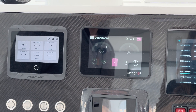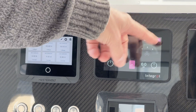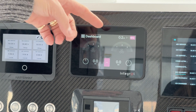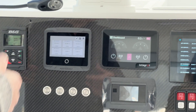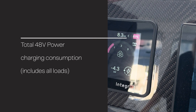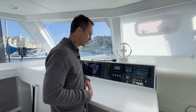So you've got a little bit finer control. The dashboard, as I said, is the main place the screen will be left — it kind of gives you your power. This is system power, which tells you how much power is either going into or coming out of the batteries. If I turned on air conditioning and fridges and things, you'll see this number change because it's pulling out — it's a summary reflection of what the batteries are actually doing.